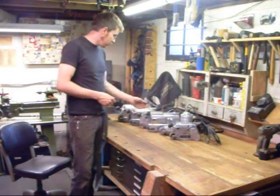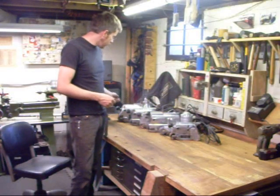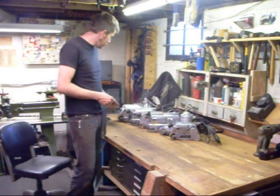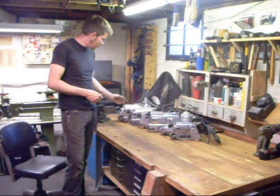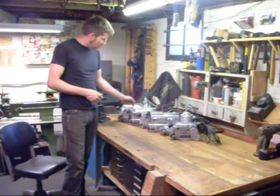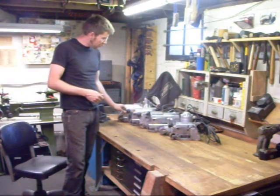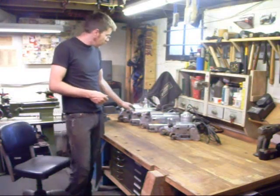The A2, the 503, the T33, the A3, and the BB10 are all disassembled by removing the screws in this front casting, removing the brush caps and brushes, and then working this piece loose, which will bring the field out with this casting.